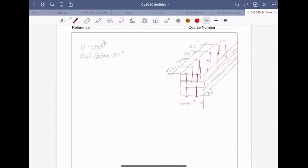Yeah. So anyways, my drawing sucks, but you guys get the idea, right? And then the stitching would also occur below, at every 2-inch spacing. You guys follow? Yeah. Okay. And the point is to stitch this to the center one. And because it's symmetric, top to bottom, it's mirrored from the neutral axis. So here's your neutral axis. And because it's mirrored, essentially, if you solve for the top one, you solve for the bottom one also. Okay. So in my mind, the question is, is it shear flow or shear stress?